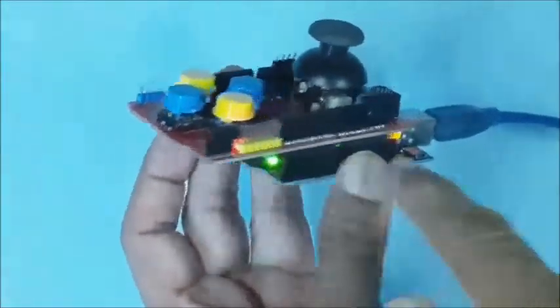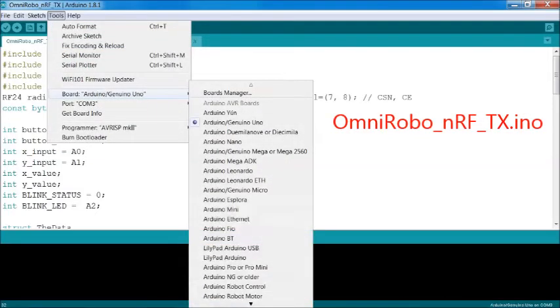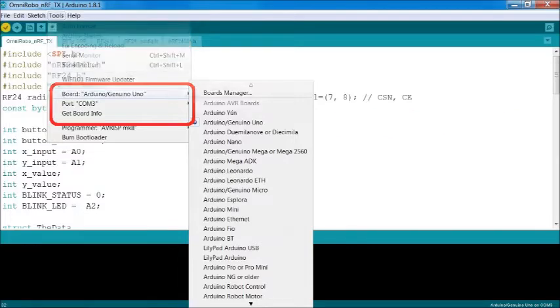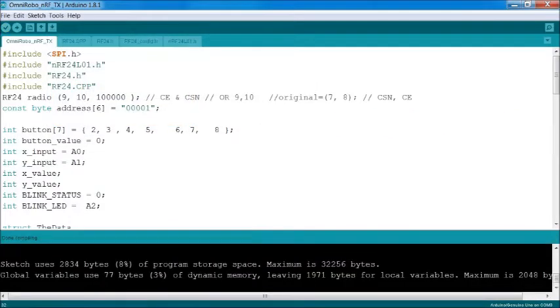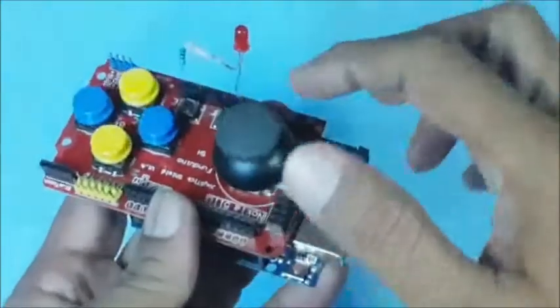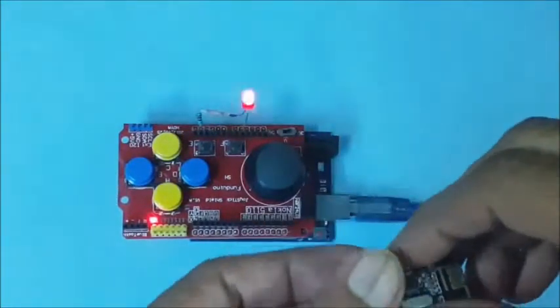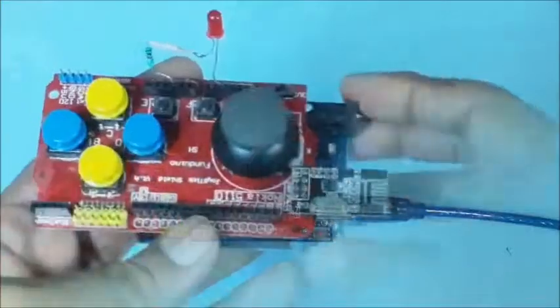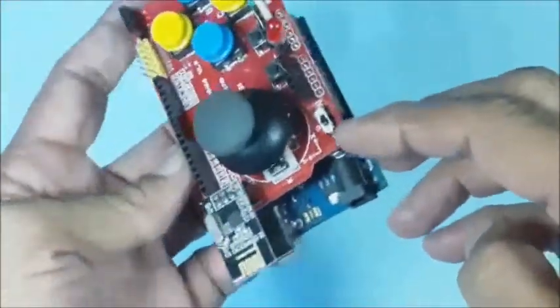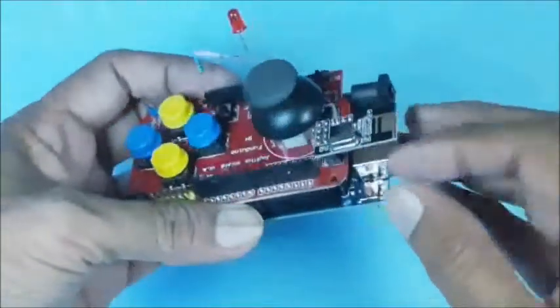You may observe the power indicator LED glows on the Arduino board. Now open the Omni-Robo nrftx.ino sketch file using Arduino IDE, then click on the tools menu and select the Arduino Uno board. Then compile and upload the sketch to the Arduino Uno board used for the transmitter module. Here another LED is connected across pins A2 and ground with about a 2.2K series resistor. When you connect power supply to the Arduino board, the LED starts blinking as a status indicator. Then connect the nRF24L01 to the Arduino board after disconnecting the power supply, and using the slide switch select 3.3 volts on the Arduino board for the nRF24L01. Now the transmitter module is ready.